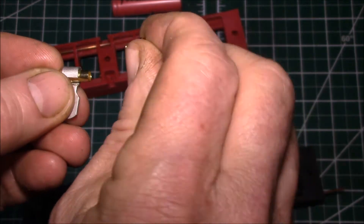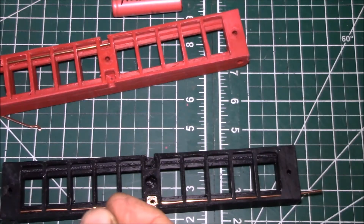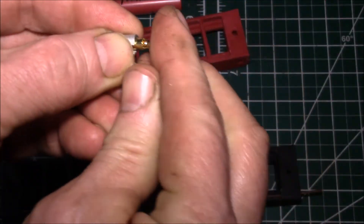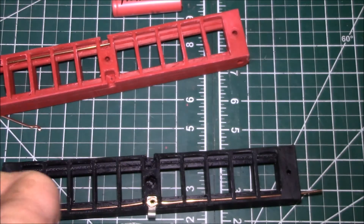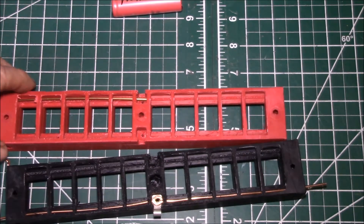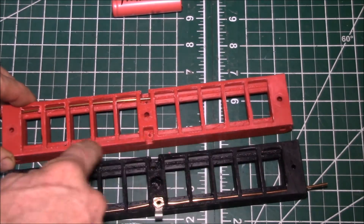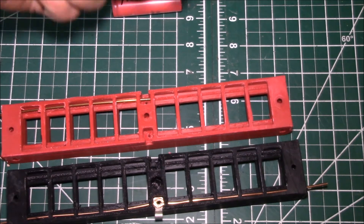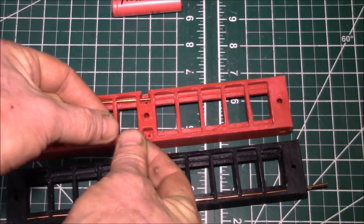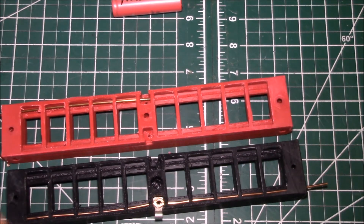With this setup, the whole pack will be standalone — just this with the little bullet connector. I can make jumper wires to go between packs and solder that onto the end, so I'll be able to just plug my jumper wires in when assembling the packs. With these, you have to put the packs side by side with spacers between each group of cells, slide them onto a threaded rod, hook up your jumper wire, slide the next pack on, and hook up the next jumper wire.